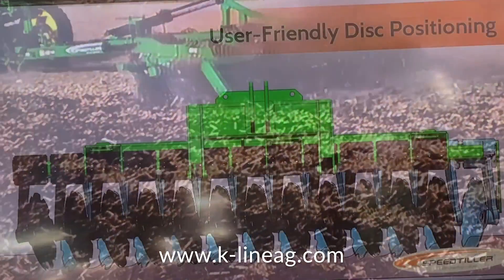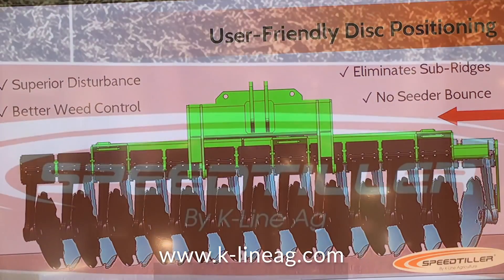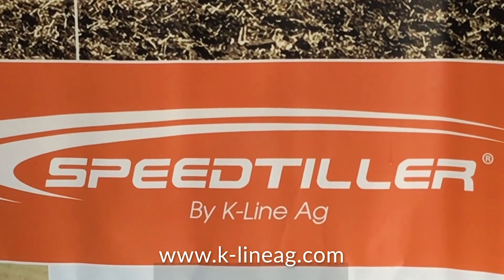The second most common roller is a spring roller, which performs better in wet, sticky conditions — as we can see it's very muddy here. It still allows dirt to flow through the roller, leaving a nice compressed seed bed finish. The least common is the rubber roller, which we don't recommend for machines going more than three inches deep — typically it's outfitted for secondary tillage or field finish applications.